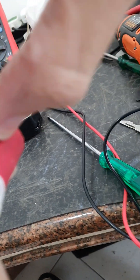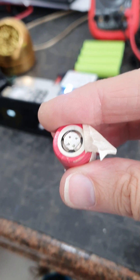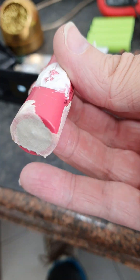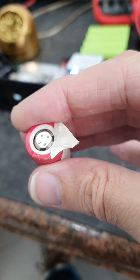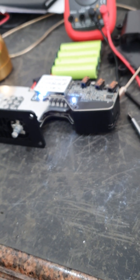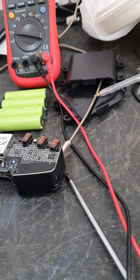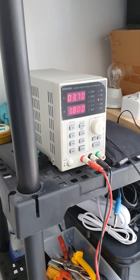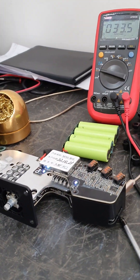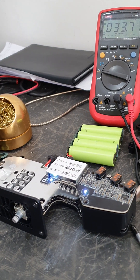Let me pull this off and show you — yes, a dome top. What happens if anything goes wrong, they vent basically. There's actually a way to fix those if they've got no continuity — they're dead — but I know that method. These ones here are unprotected. So to charge them I took my bench power supply and set it to 3.7 volts, limiting the current at 1.8 amps, because if you don't limit the current these things can draw like 4 amps to charge up.